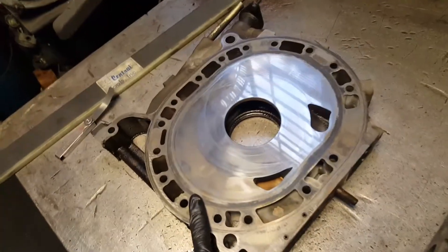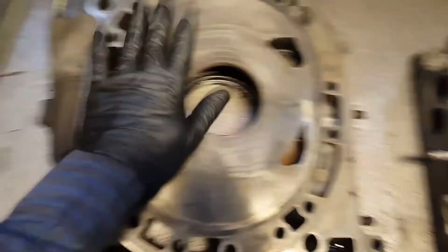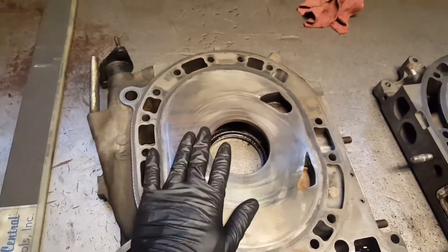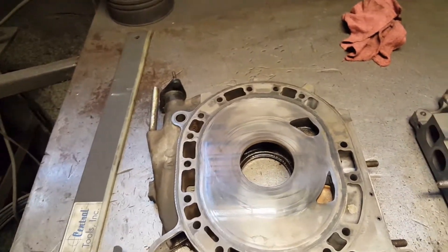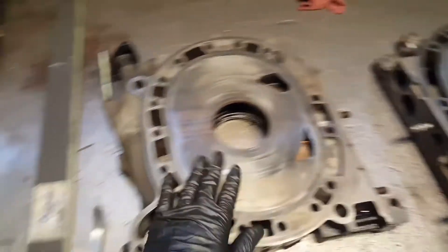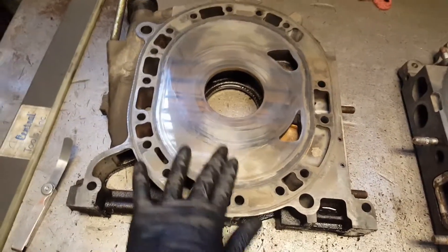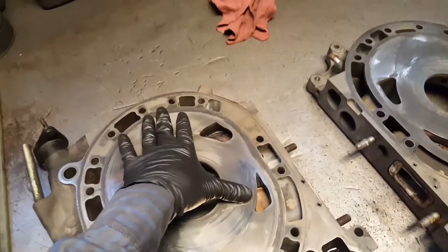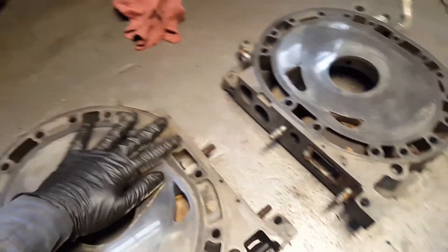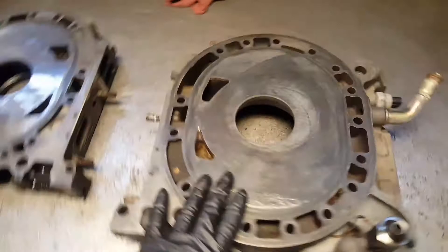This one is good — it's clean and can be reused. You can either lap it or resurface it. The maximum wear tolerance on this one is 0.004 inches, and I'll show you how to check with the ruler. Most likely this is gonna be lapped. The hot spot on these irons is at the 3 o'clock position — right around this side here.